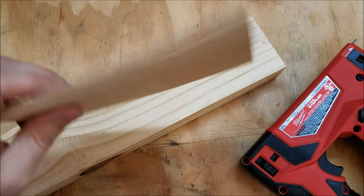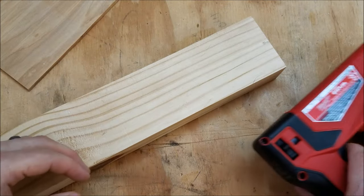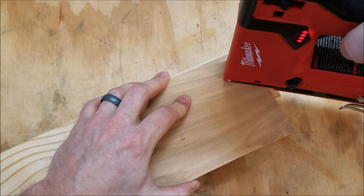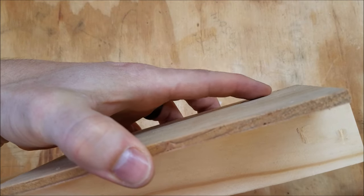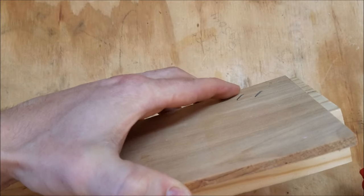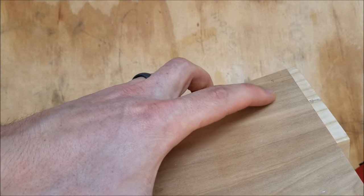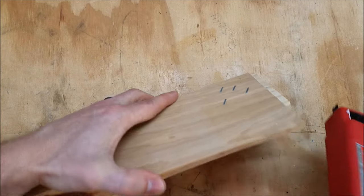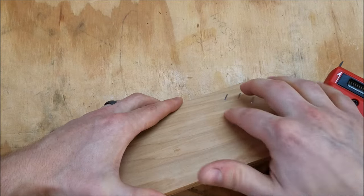Next I've got some quarter-inch hardwood plywood into regular pine, and I'm using half-inch staples. Those are going in just about flush — it's actually sinking them slightly below the surface. There's a little bit of a raised-up bit but the top of the staple is actually partially in the wood. No misfires, no mangled staples — it's setting them great.